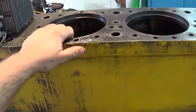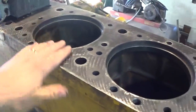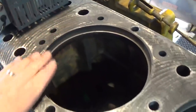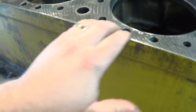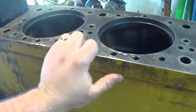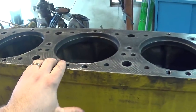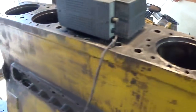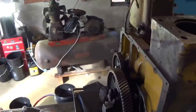I also gave a little clean-up to the cylinder block deck here. I'm waiting for a 3-foot straight edge that I ordered in order to check the surface flatness and make sure I don't have any low spots that are going to cause me grief down the line.